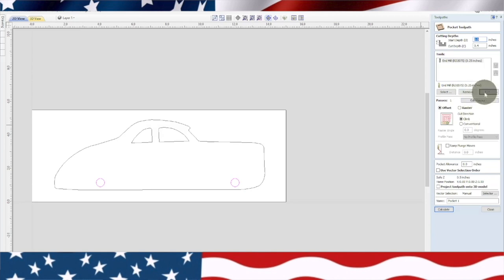And this bit is an RD5200. It's basically a spiral down cut, solid carbide, 2-flute, 1/2-inch shank. It's a down cutting bit that'll cut 2 inches deep. And my material's 1.5 inches. So right now we're going to remove this tool.